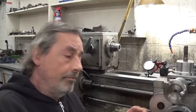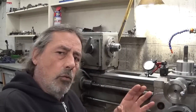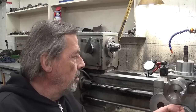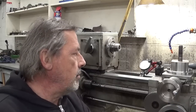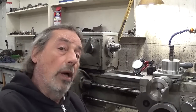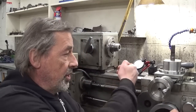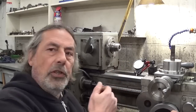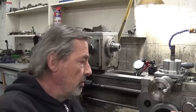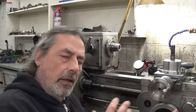I'm back. I think we're getting a little bit closer here. For the moment I have about three one-hundredths of a millimeter side-to-side play — for the imperial folks, that's more or less one thou. I think I can live with this.